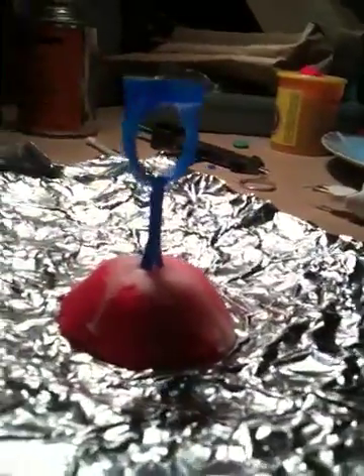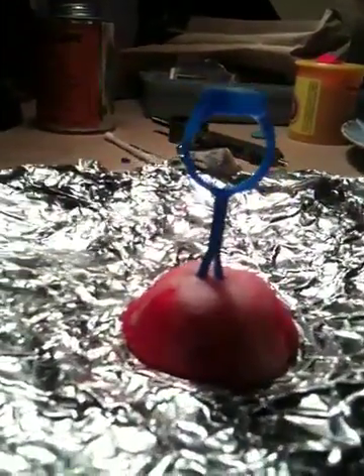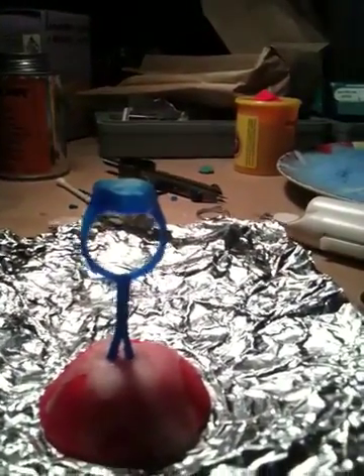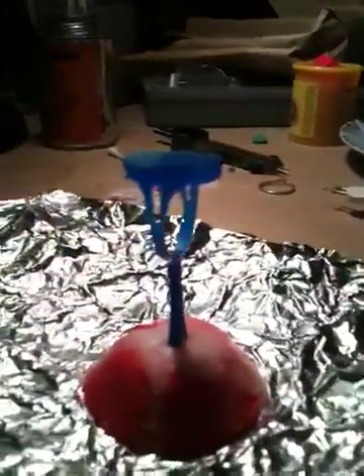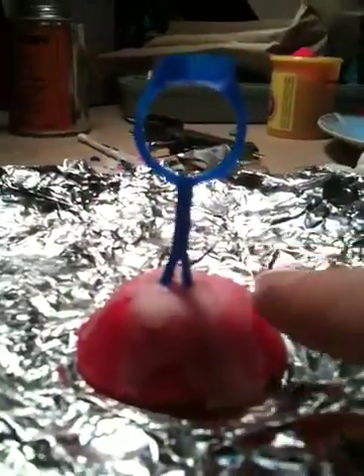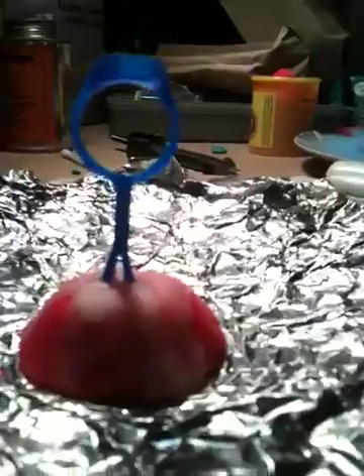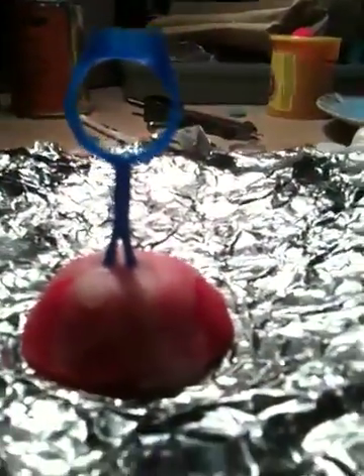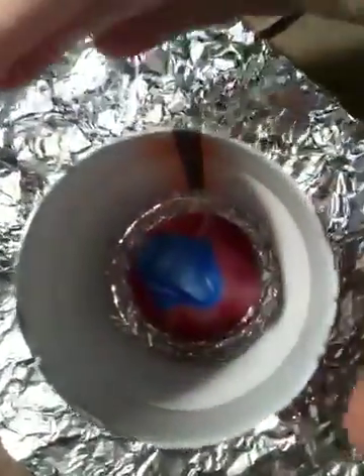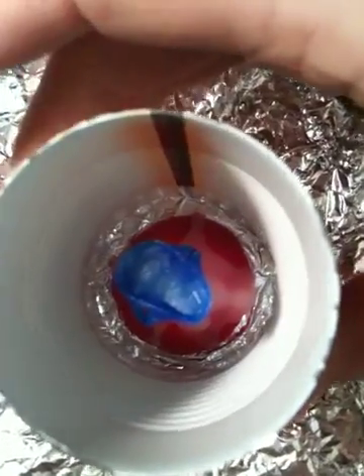I'm going to show you how to do that in the next video. So what you need: 8 gauge wire, your wax ring or whatever you plan on making, some Play-Doh or clay to make your little base. It needs to be just like this — half inch high, tapered edges, and flat on top. When it goes into your can, you need about a fourth of an inch of space around the whole thing so it's not touching.